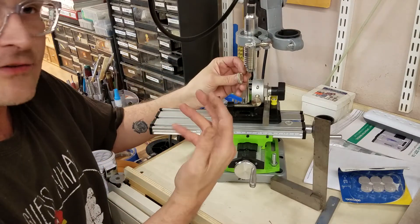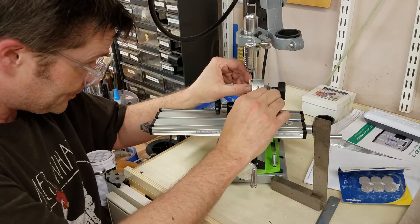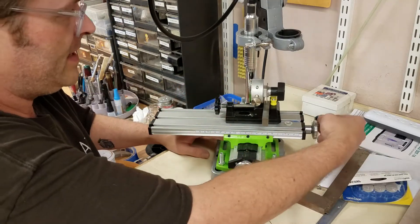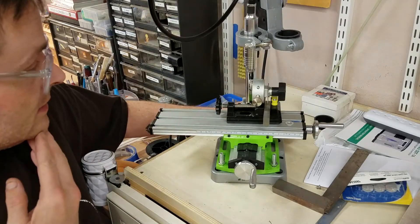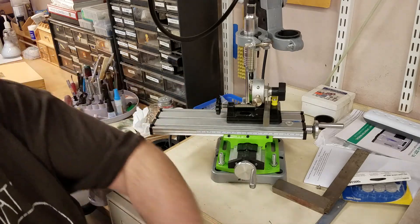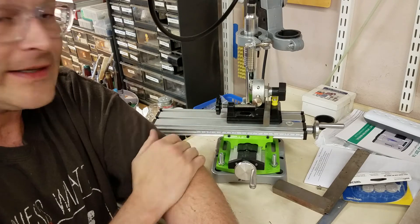I wouldn't have really known this except one of my mentors never had a GRS — everything was done with a gravers block. That's how he held rings; never had one, though I think he has one now, but he's in his 70s. Just straighten it up there and having a regular surface — with this I can get it wherever I want it, put my bit in, and come down at a 90 degree angle. Cheap and simple way to get 90 degrees on an irregular ring or anything. You chalk it up, flip it over, put it in the vice — you have to adjust some height — but there you go.